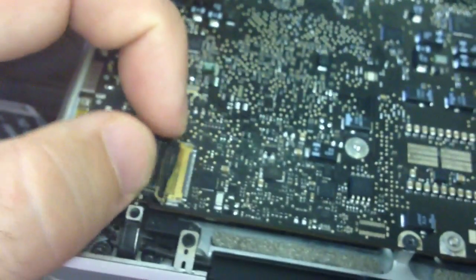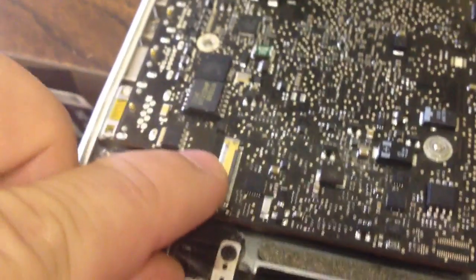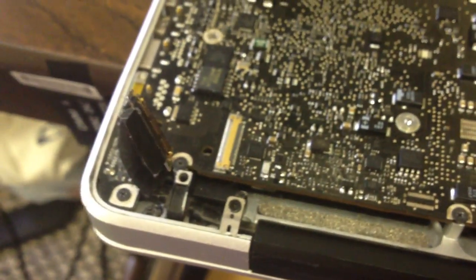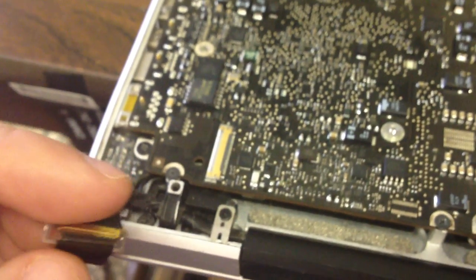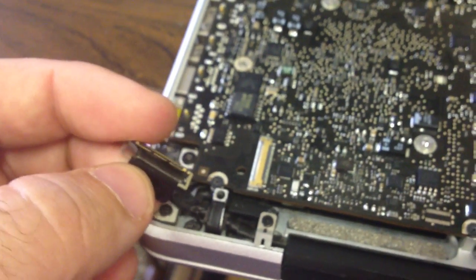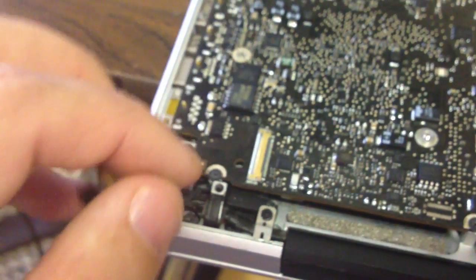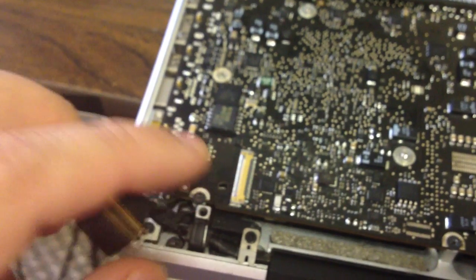This bar is for securing the LED screen in there. But what you're seeing is a piece of this plastic gets hot and will melt. With an LED screen, this port supplies both signal and power. So what you're having is the power pins are getting hot, causing the plastic here to weaken — or somebody's pulling on this and it's ripping the plastic when they're plugging and unplugging it — and it causes this metal bar to touch one of these pins and short the system out. It fries this chip, which goes directly to the LED power, or it'll fry one of these pins on here. Fairly common.